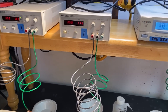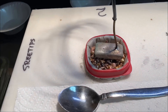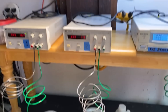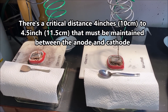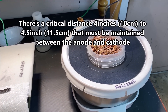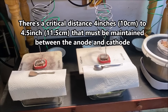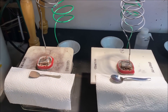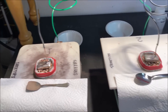A couple of things to note: the current flow is going to fall off as the anode filter bags become clogged up with the silver cell slimes — that's why we're seeing reduced current flow through the cell. The silver crystal is still way down into the cell and not much danger of coming in contact with the anode filter baskets. But I'll install some inline fuses so that if silver crystal grows up and makes contact with the filter bag, it'll blow the fuse and protect the batch of silver.